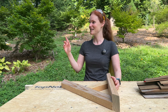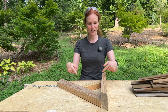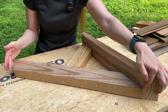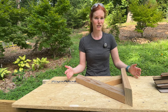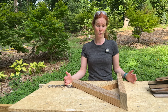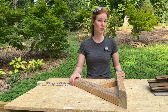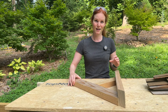First thing we're doing today is getting this little roof set up for the shed. What you're looking at right here is the wall of the shed, and this is where the cedar shakes will be on the roof. This board here is two feet long from this point to this point, and this is also two feet long. It's 45-degree angles and 90-degree angles, so it's pretty simple. I've seen a nice example using 20 degrees, but that was for a much larger roof with a four-foot overhang. This is just two feet, so I think this will be plenty of support. I have a template for the whole roof structure and I'm just laying it on top of each board and marking the lines, so I have a consistent measurement each time instead of using the tape measure, which can be inaccurate.